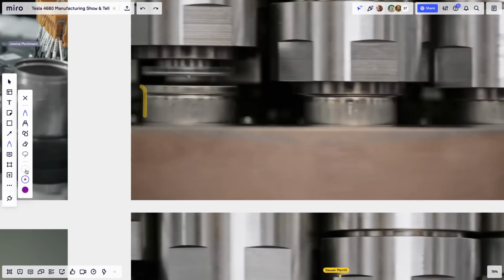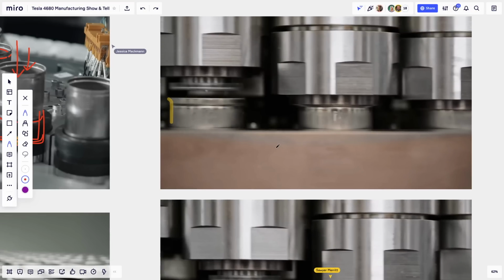You can see this here, there's a little pin. Do you guys see this pin right here? Yeah, okay. So this pin is the center of that metal cap that's being pushed in, and that's going to get crimped. So it's going to be a mechanical sealing, like any of your canned goods. You know, it's rolled metal over metal, and it's done tightly enough that it's completely sealed.